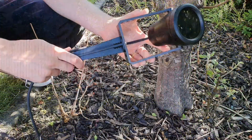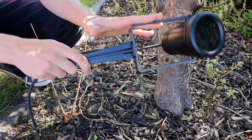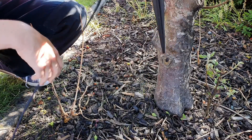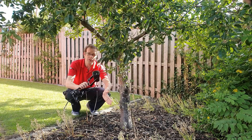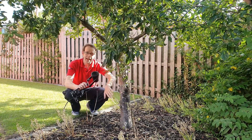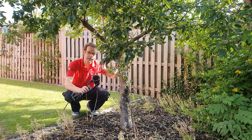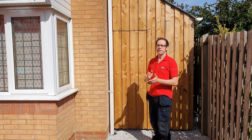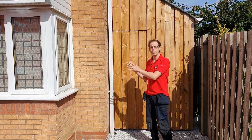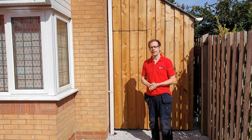The great thing about this fitting is that it can be mounted in one of two ways: either wall mounted on its integral bracket, or as we're going to do, we can attach the supplied spike and place it into the ground. I'm going to put one at the front of the tree quite close so that it really illuminates the trunk from the side you approach, and then the other fitting a little bit further back, angled upwards to really illuminate the foliage. These fittings will be fed from a fused connection unit off a ring final circuit on this side of the property.